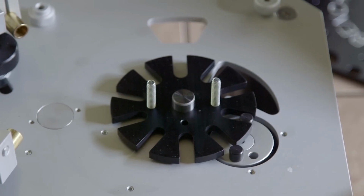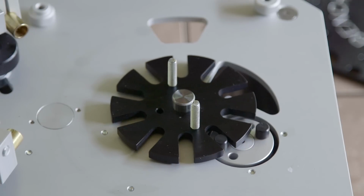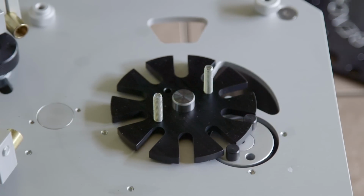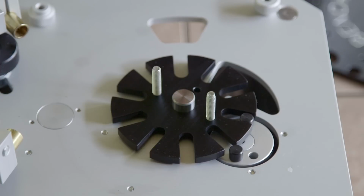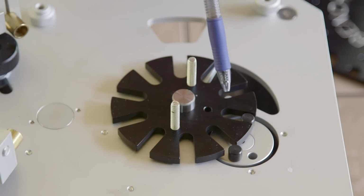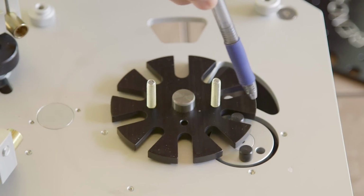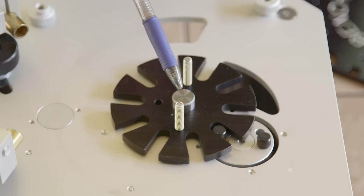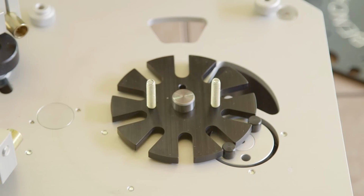Just for fun, let me show you the Geneva wheel in action. Now, something to really observe here, and you'll understand later why this is so important. Notice that when the indexing wheel comes around, or the pin comes around, it actually strikes the edge, this side of the slot, and drives the Geneva wheel backwards, ever so slightly. Watch it. See there? Now watch this screw here, back. You see that? When it stops, it backs up a little bit.